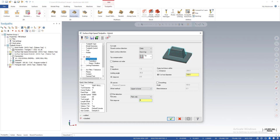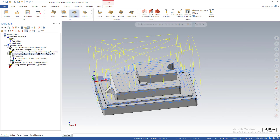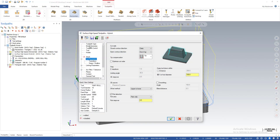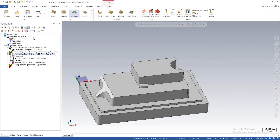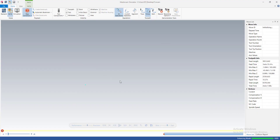With the hybrid toolpath, when we activate the flat detection and only machine flat areas, we can use this toolpath for cleaning the horizontal surfaces on the part. Even with floor stock left at 0.1, no problem. And when I clean the floor with zero stock to leave on floor and run the simulation — it works well.